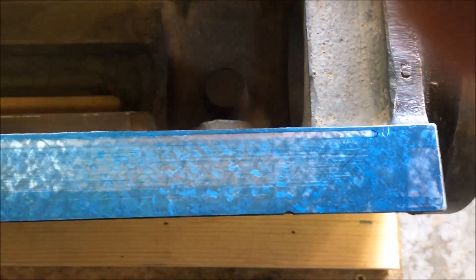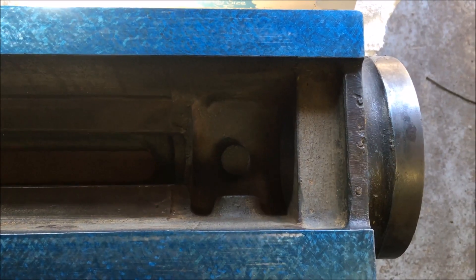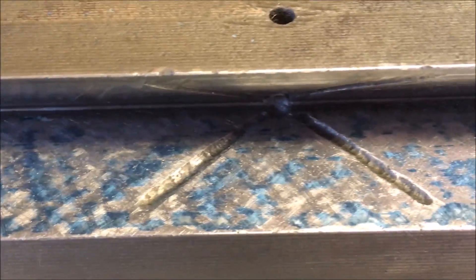Looking at the printing surface — that's the edge that goes under the dovetail. I'm guessing it's had some debris going under it. Going to clean it off and reprint without touching anything. Having cleaned it off and re-inked it, you can still see a mark. It's like spot-the-part that's causing it. It's a better print with more contact further in, but there's obviously something in there causing that scrape mark. Those dark areas need dropping, but it should be on the near edge.